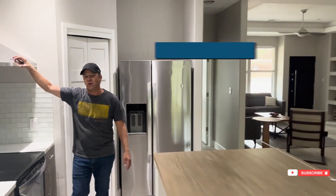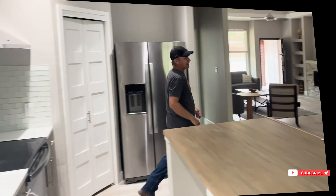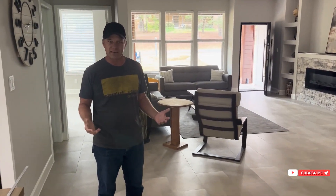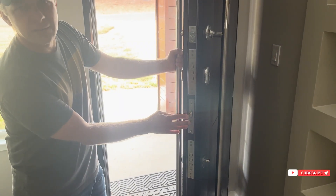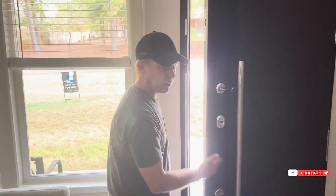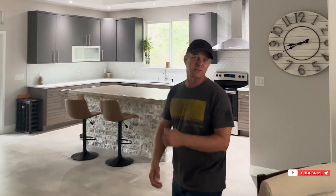Make sure you get that front door open. I love showing that because it's an excellent demonstration of depressurization actually happening. It really actually happens — when this door isn't locked, this is what's keeping it closed. You just pull it open. It's a great example of how homes get depressurized. This house happens to be super tight — it was actually the first house where I put a lot of effort into tightness, and it came in under 1 ACH50. Effects like that are going to be a little bit more obvious.